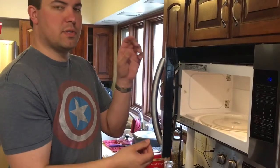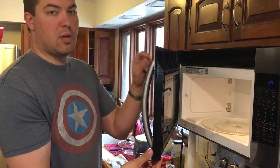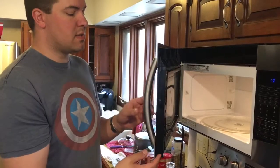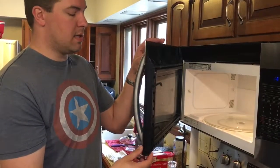If you do it too early, the putty will just pull out of the back of the handle and the screw won't hold anything. If you wait too long, the putty will harden and you won't be able to screw in at all. So wait the appropriate amount of time — after about 60 minutes you can drill it, sand it, do whatever you want with it.